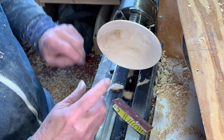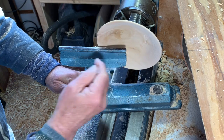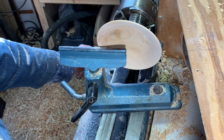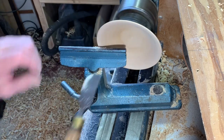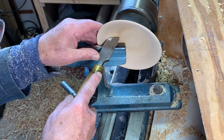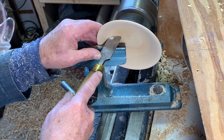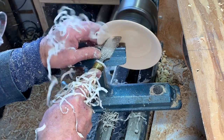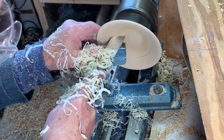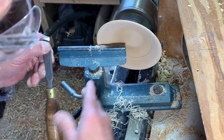One way of doing that is to have a kind of wide rim with a slight undercut, and so I can just get in underneath that, and the chuck jaws can slide out against those. So that's what I'm going to do. And as usual, the idea is to try and make it look decorative when it's actually functional. I don't want to change chucks, so I'll just have a wider rim. And a little skew chisel to get in, just to chamfer back in there.